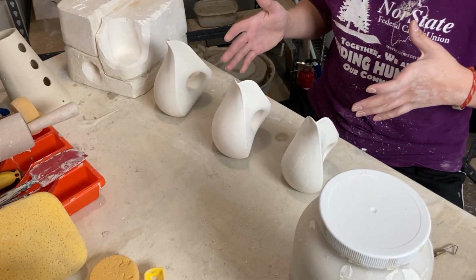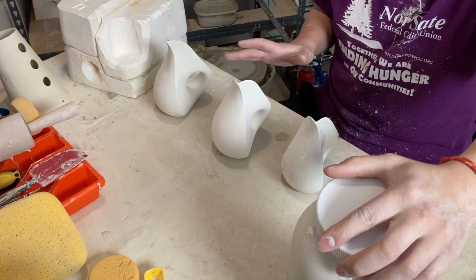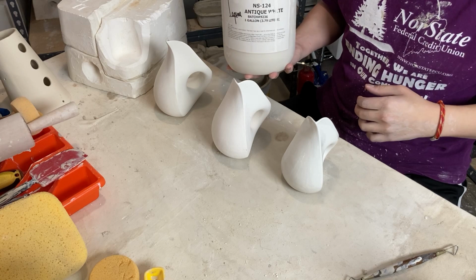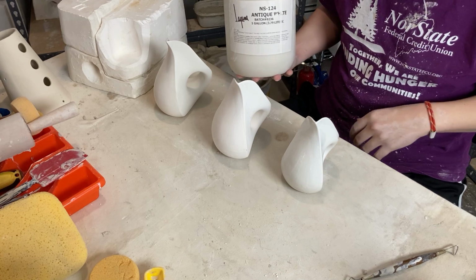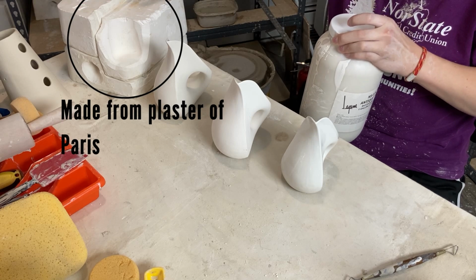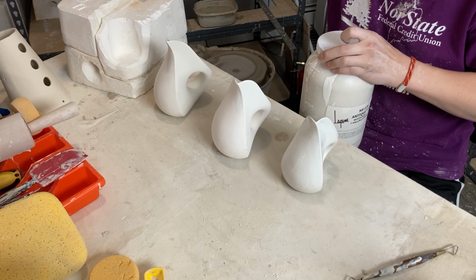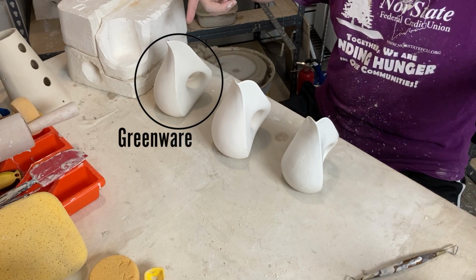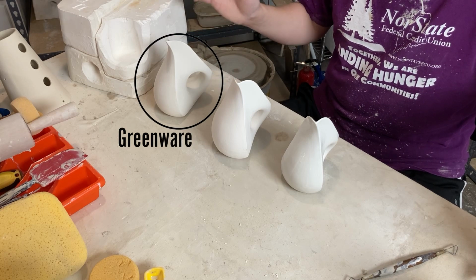Something that I thought could be interesting is the explanation from start to finish of my creamer. So here I have the material I use. It's an antique white porcelain slip, a clay milkshake, more or less. And I pour it inside a plaster mold. I have one that I cast yesterday, and I'll be demolding that soon for you. But right here, I have one that I had taken out of the mold and cleaned up, but it hasn't been fired yet, so it's actually quite fragile.